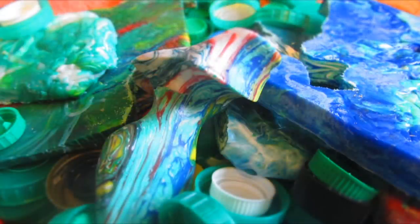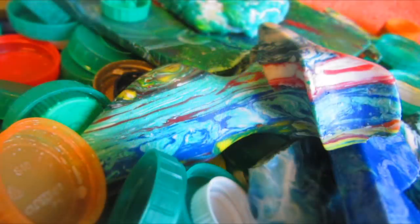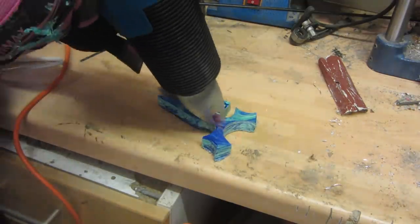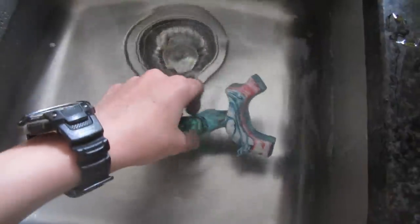Then using the sheet HDPE which I made in this tutorial I've created this new Teoh Hammer Slingshot. There's going to be a full tutorial next weekend on how to make this including the process of welding the sheets together which avoids using any glue. In the past I've tried many glues on the HDPE but it's pretty much resisted them all so welding was obviously the simplest option. Just using a heat gun I heated up all of the different layers and then clamped them together. The finished result was a very nice waterproof, durable, strong, lightweight slingshot that also floats when you put it in water.